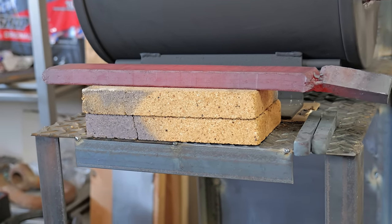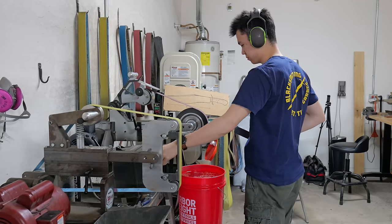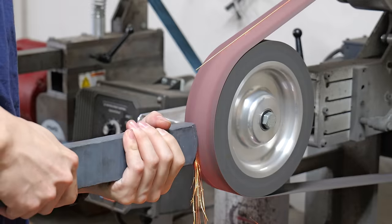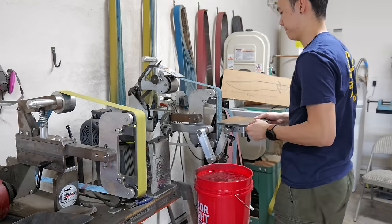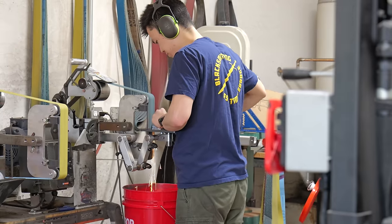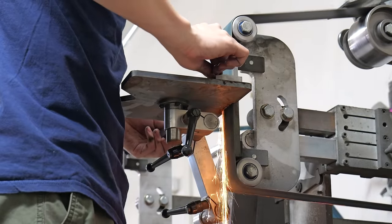Now, this does not look like a finished knife. And the reason I'm taking it to the grinder now is to check that those forge welds are indeed perfect. If my forge welds weren't good, I'd be able to see because I'd be revealing clean steel and a crack or delamination would show up as a black streak. This step could actually be the make or break in a Damascus billet. If I catch a delamination now, I actually can take it to the forge and fix it.